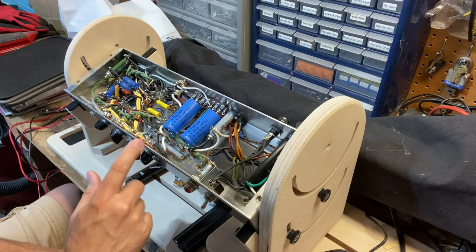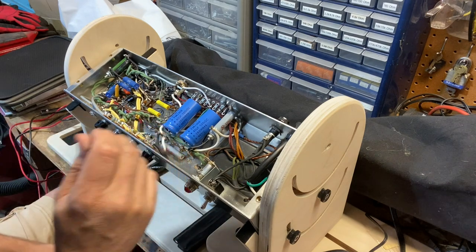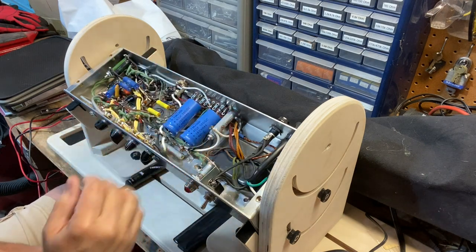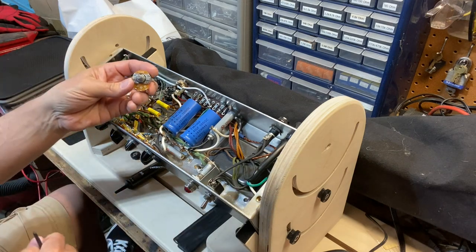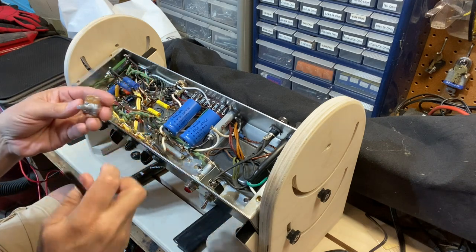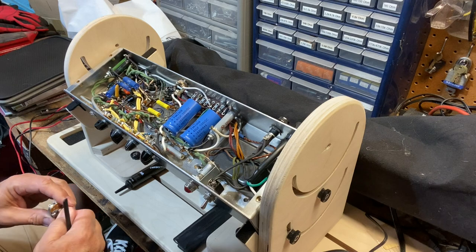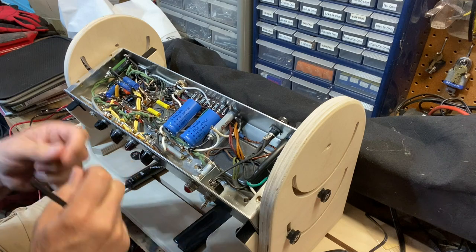This pot is a 100K, and it's a linear taper. And what does that mean? A linear taper means that the sweep of adjustment tends to come up a little bit more quickly than, say, an audio taper pot. And that's what this particular one is. This is a 100K audio taper pot. What we're going to try and do is swap those out and see if maybe we get to be at maybe 5 or 6 before our reverb gets to be too oversaturated, and it sounds like we're in some murky tunnel,